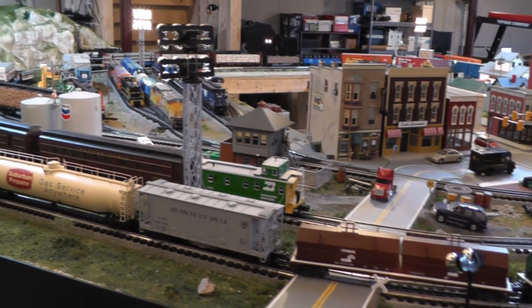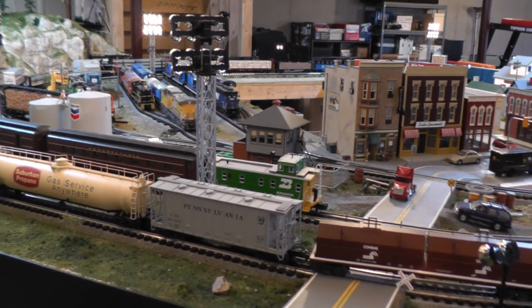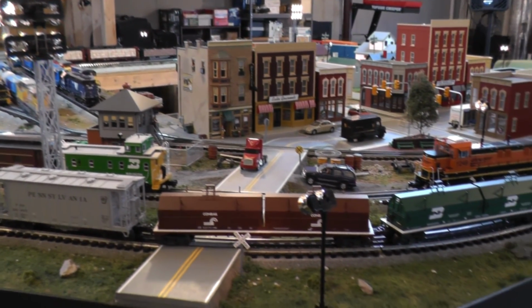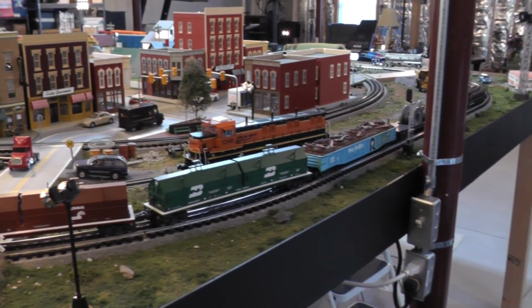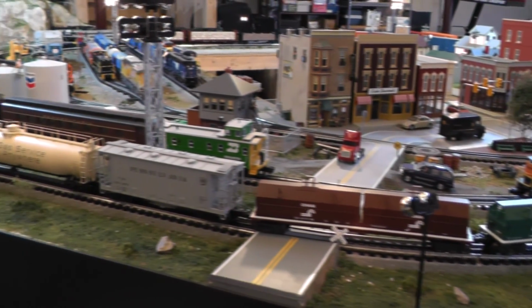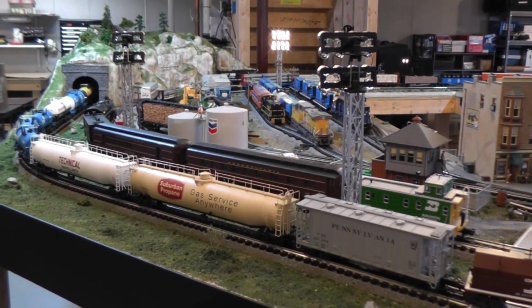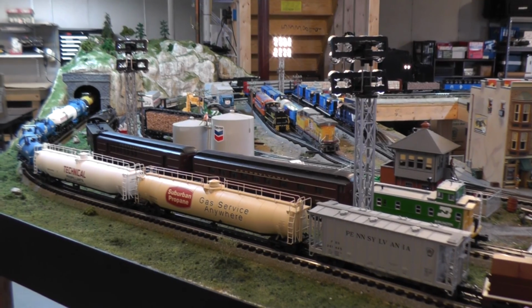And if you want to do something like that, look for one of those power adapters online. It was an old IBM laptop power adapter, 16 volt, 7.5 amp. It was real easy to cut the wire off and do what I wanted to do to it. Now it's DC, so you're not going to be running accessories off of it most likely, but I was doing bulbs and I figured I'd probably like to run my bulbs off DC instead anyway.